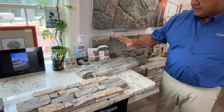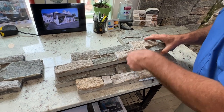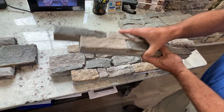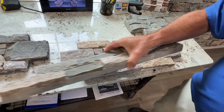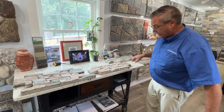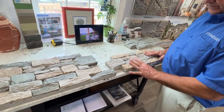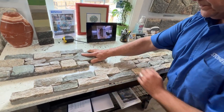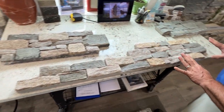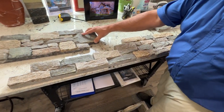There are three components: the full flats and then there's a half flat. If you compare the half of a flat — if you took a full flat and cut it right in half, you'd have two half panels. These half panels are probably best described as a starter course. Say you're doing a 100-foot foundation: you start with a full panel, then go to a half panel, then over to the left you start with the full panel again, and to the right of that full panel you go with a half panel. But once you have the base course set up, it's just all full panels.